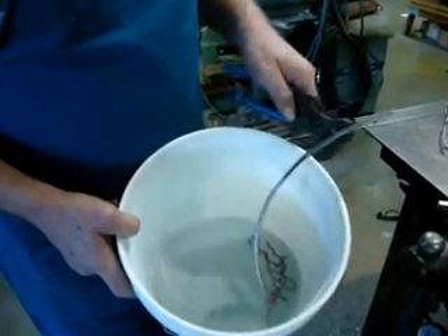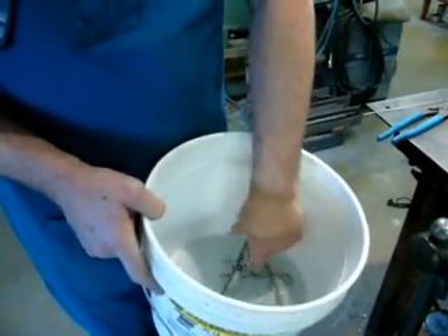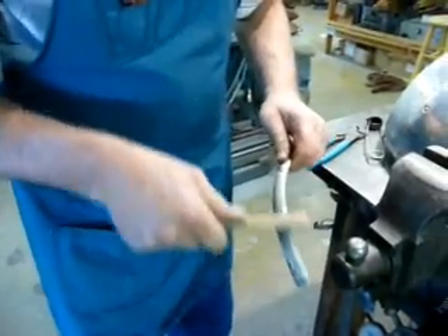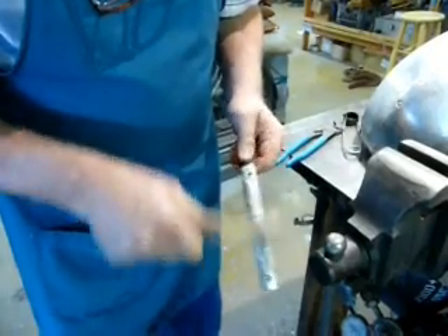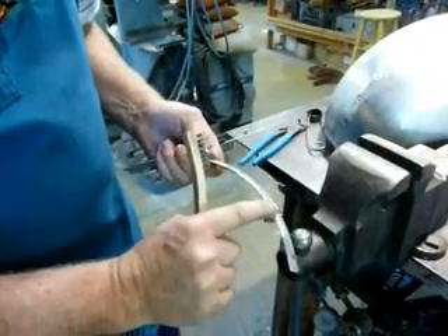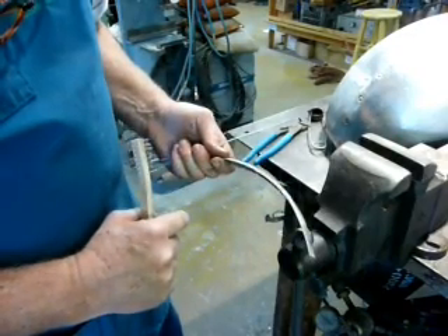It's going in the water wash. I'll get some water on there and come back at it with a stainless steel brush again, because I just don't want flux blowing all over the shop when I sand the aluminum. You can see now — if you look at the profile — the profile's nice, and there's a nice build-up.